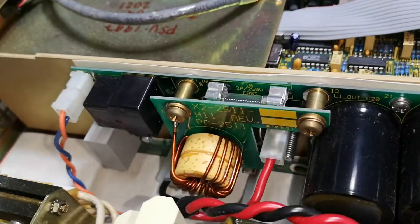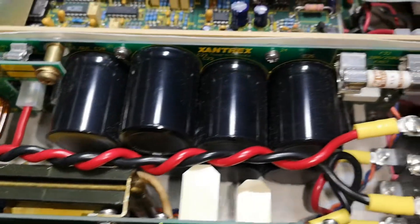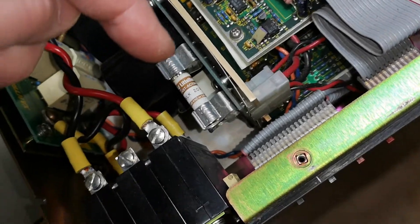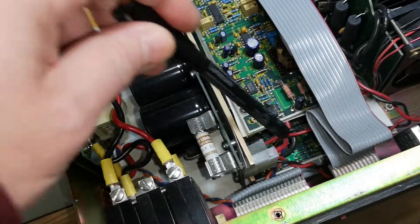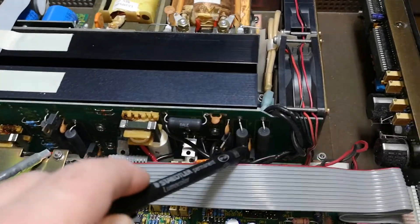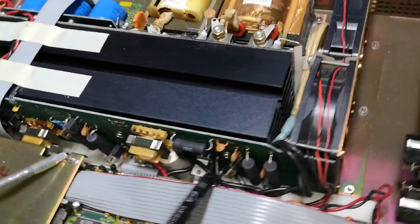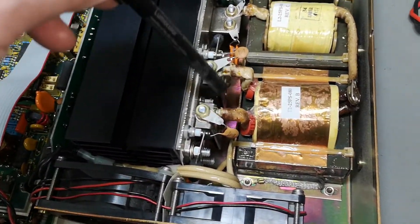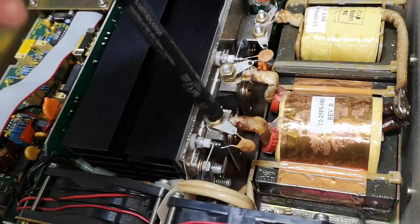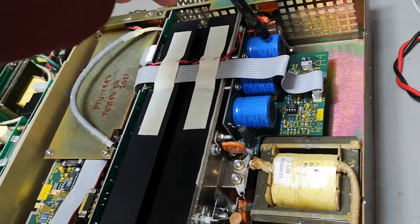There's a big rectifier down there somewhere and the charge capacitors for the DC bus. Then there is a DC fuse of also 20 amps. The big powerful DC I think goes straight to this board — this is the drive board, the power drive board — and then here is the power stage, the inductor, and then the output filter.